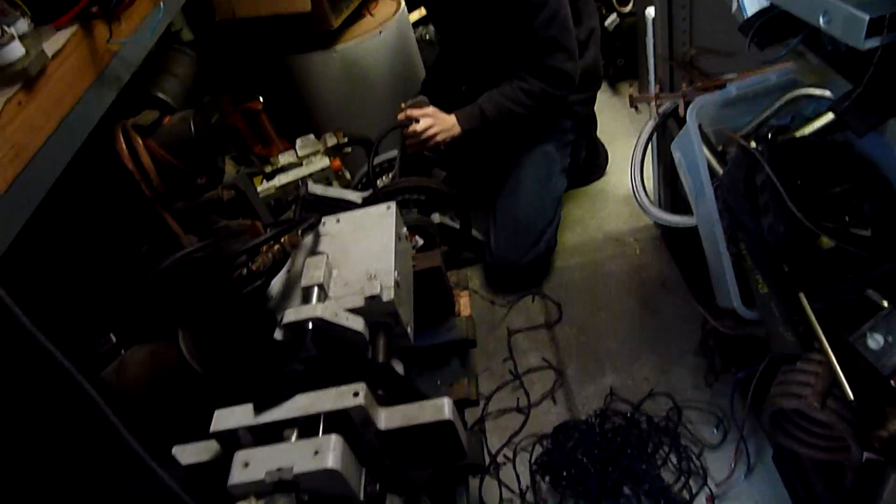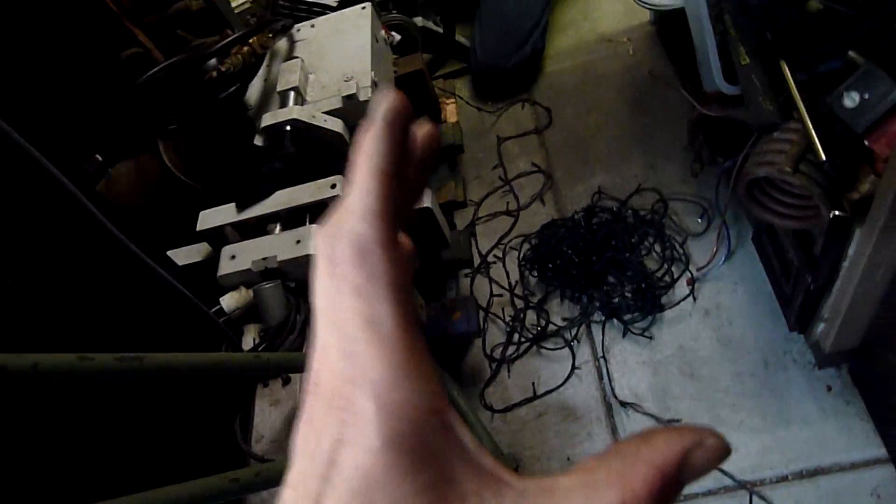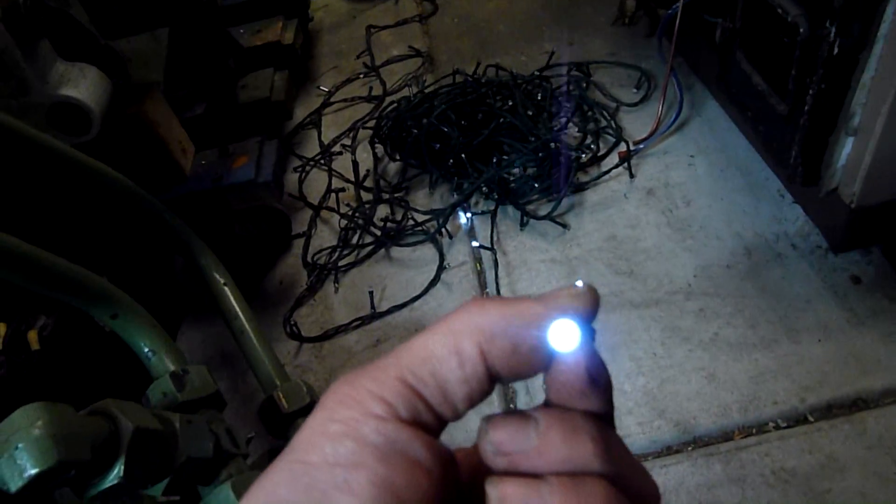It does weird things when connected to three-phase power because there are three wires on the LEDs. I'm guessing there's either a centre tap somewhere and two power wires, or it could possibly be a simulated three-phase drive from the power module. Give that thing a little bit of a spin — just barely move it. They pulse with the current coming out of it.